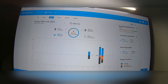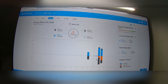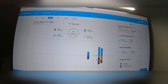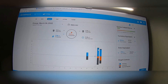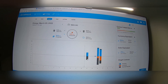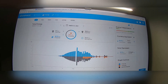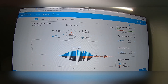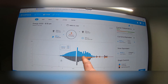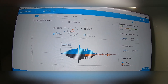It's not really a mistake on my part - it was more of a consumption meter issue on their software side. On the first day I installed it, one weird thing you'll see when you first turn these on is all this gray in the background showing electricity that was supposedly fed back - but that's not accurate. The meters weren't actually on those first two days so it just assumes all the electricity went back. Coming down to yesterday, you can see where there's no orange - that's prior to the consumption meter being plugged in - and this is after it was put on. It automatically assumes all of that got fed back to the circuit, which it didn't.